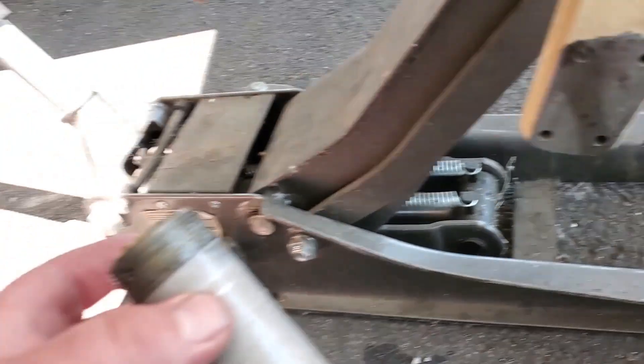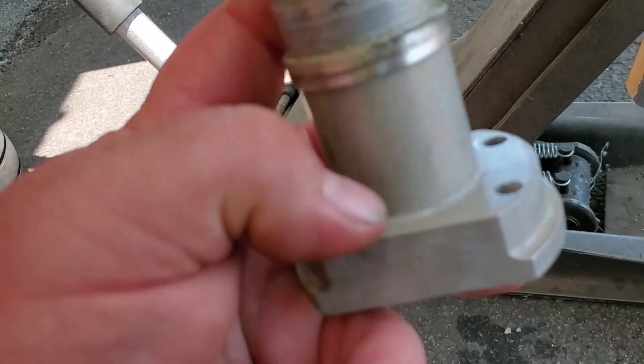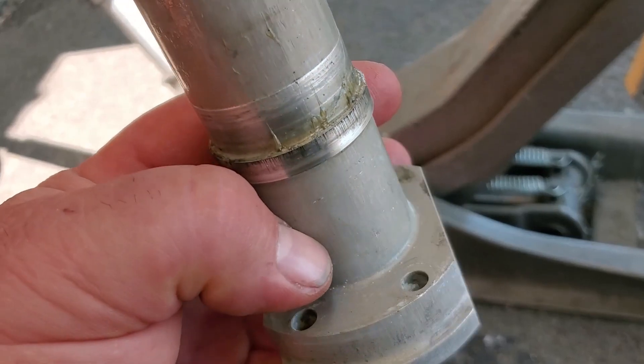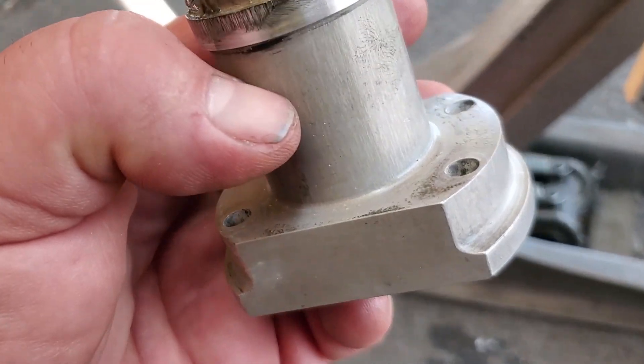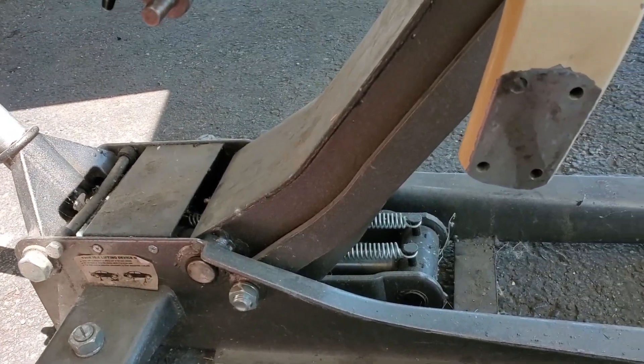So there's been a rash of broken axles on the Cessna 140 because they're 75 years old. And we'll show you one here. This axle here was on this airplane and we dye-penned around the base here where it transitions into the flange where you bolt it on, and it was cracked. It was showing indications of cracking with dye pen.